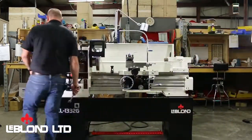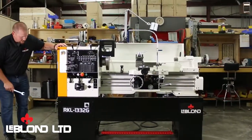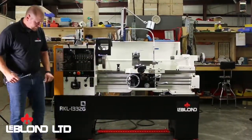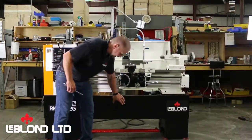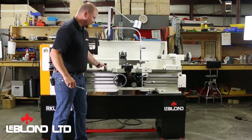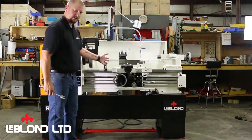Same with the 2 on this very end. They are just to stabilize and kind of hold this head in place, so to make it easier, you can do all your leveling within the bed. Now if your machine was a lot longer and you had extra feet coming down off your machine, you would also always want to make sure you put the level over top each foot that you're leveling on to get your best accurate reading.